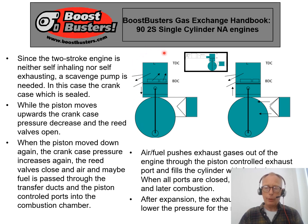We don't have any poppet valves on this type of two-stroke engine — just a flat cylinder head whose only purpose is to keep the spark plug in place and keep the cylinder sealed. Instead of poppet valves, we have ports, which are basically holes in the cylinder walls. When the piston passes the holes, we open and close the ports — this is called piston-controlled ports. These consist of transfer or scavenge ports connected to the crankcase via ducts that take air and fuel from the crankcase.